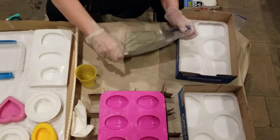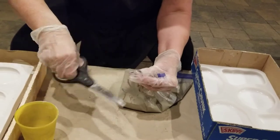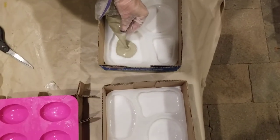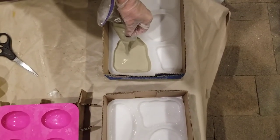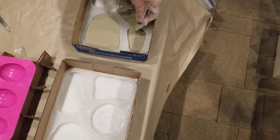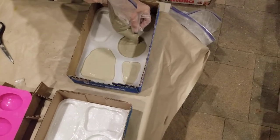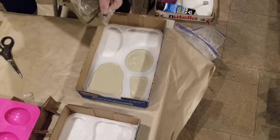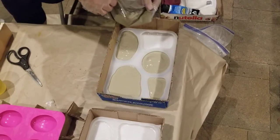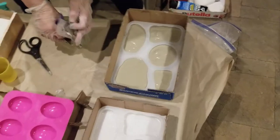Make sure your seal is there. Put the concrete to one side and cut a nice-sized piece off the corner — eventually as it gets thicker, it gets hard to get through a small hole and you don't want to waste time. You don't want to necessarily overfill the molds either; that'll just make you have more to file off later. If there are a few clumps here and there, don't worry about it. That just took a whole bag.